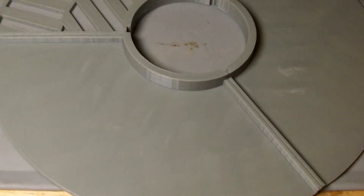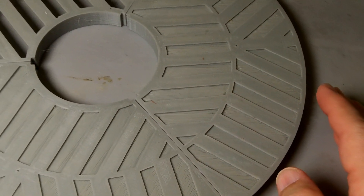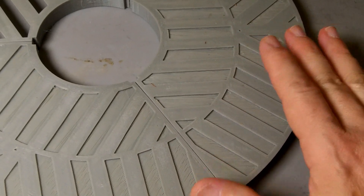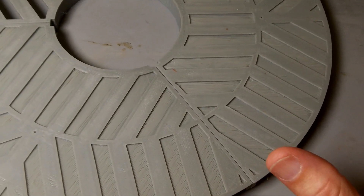This prints in three sections. Two of them are identical and one of them has the actual mask pattern. The two that are flat have the mask pattern on the bottom — that makes the ABS plastic not lift up. It sticks better that way, so when the plastic warps a little bit, there are some gaps to allow that warping to happen without popping off the build plate.